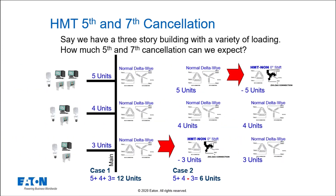If we do the same thing but pick the bigger transformer with more load, we go four plus three — seven minus five equals two. We've cut our harmonic current from essentially 12 units, say 120 amps, down to two units or maybe 20 amps. That's a significant reduction. So any phase shifting can help and we can cancel out the harmonics.